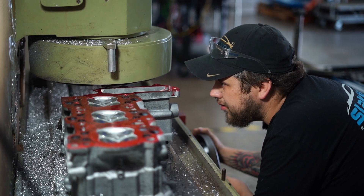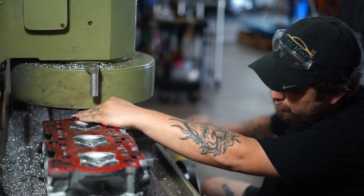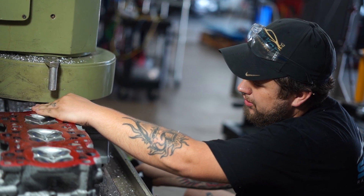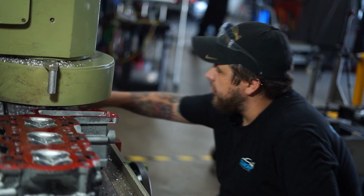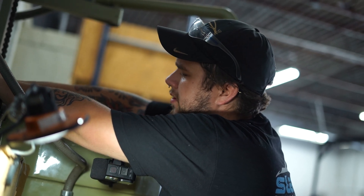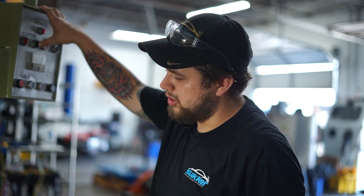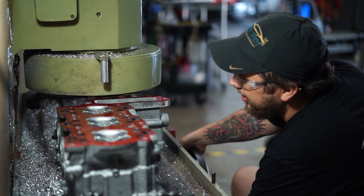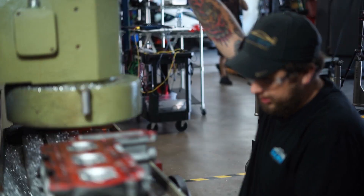So for touching off on the heads, usually we'll use a piece of paper right underneath the cutter. This machine has a one-insert CBN cutter. We'll just slide the paper around under there, slowly lowering the head until the paper starts to catch some drag on the cutter — then we'll know we're about five thou away from the actual surface. We'll set up the indicator so we know exactly how much we're moving. The dial on this machine for height adjustment is fairly accurate, but this indicator gives us down to the fifty-millionths — super excessive, but also a lot more insight. Turn the machine on — safety first. We should be about five thou above the surface right now, until I hear, see, or feel that it's starting to cut.